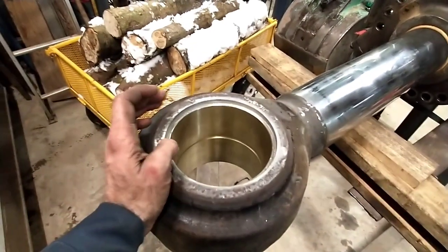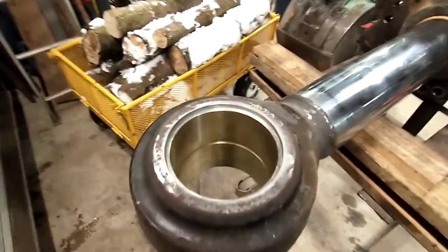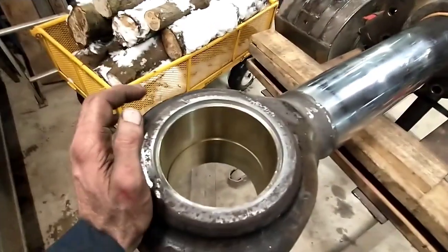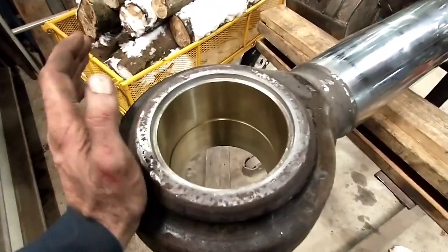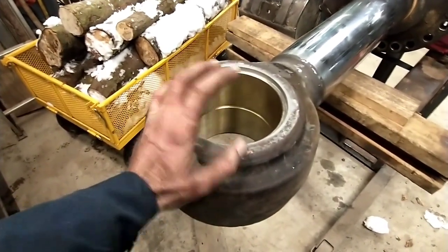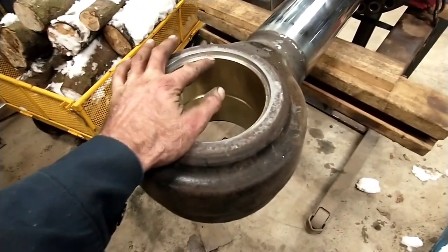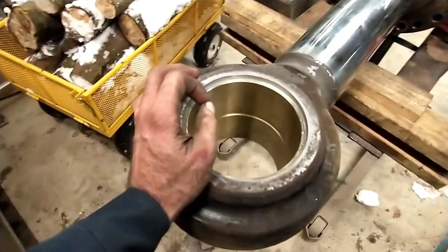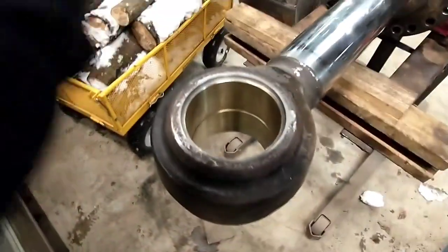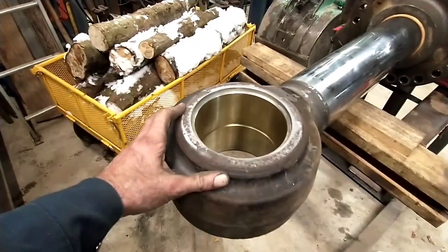Came out really nice. I put ten thousandths press fit on this - it's a five-and-a-half-inch bushing, so I've got just under two thou per inch, which is pretty much what I normally shoot for on a bronze bushing. Helps keep it from walking out. I don't know what factory spec is, but that's what I gave it. Came out just great. The only funny thing is it's a real hard bronze - I was having trouble getting it started. What I did was stick it in the lathe and for about three-sixteenths on the end, I basically just shaved off the five thou on a side that was the press fit, took it to a size-for-size fit so I had a pilot, let me take a dead blow and get it started so it wouldn't shave going in. Then went ahead and shoved it in. Came out real nice.